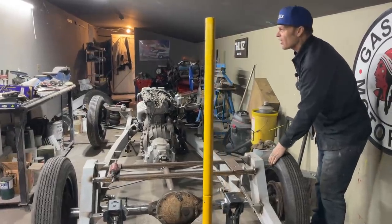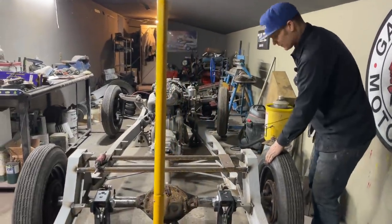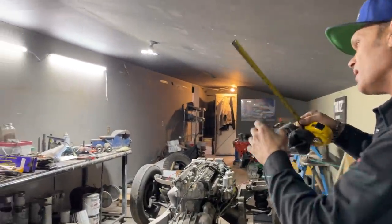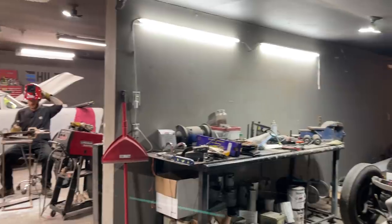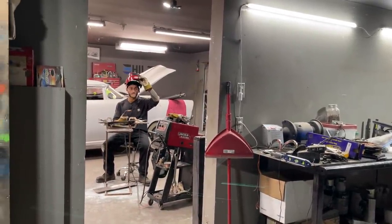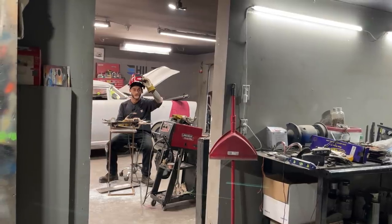Too close. Can you tell that? Yep. Cool. So when you go to do it next time, just make the adjustment of the distance away that you need to be. Even though the wire's not hitting the metal, you have to keep that distance and then pull your trigger.